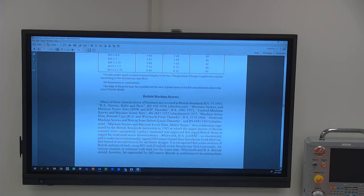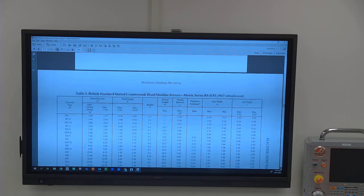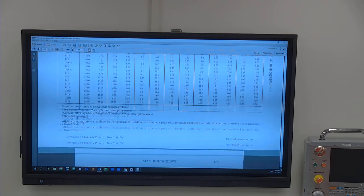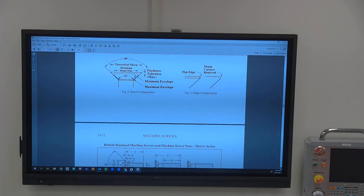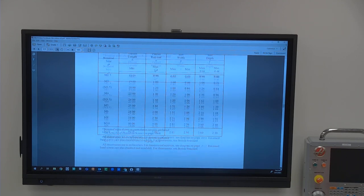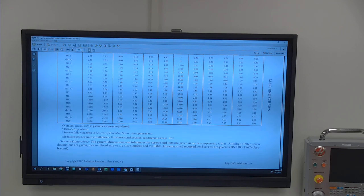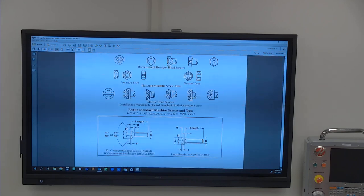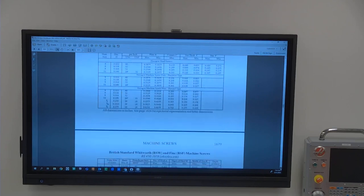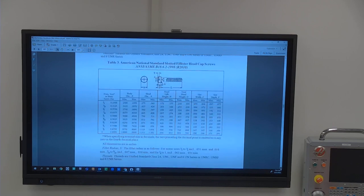And really, one of the reasons that you're not going to find a lot of information on a screw, like when you go to make a screw, is that it's already given to you as standards. So when it says 1/2-13 or 3/8-16 or M10, those are already established, so they don't need to come up with an individual pitch diameter and everything for each one because we have the standards to work off of.